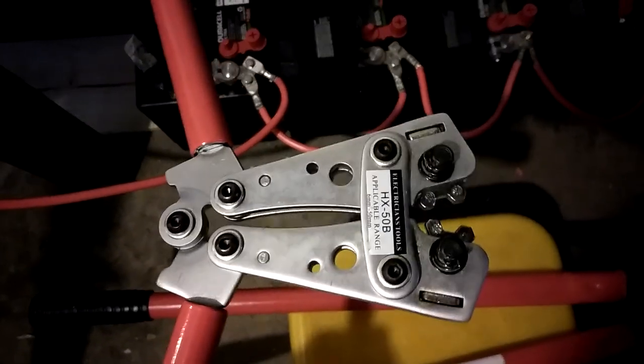If you're getting wire cutters, I have to suggest this: you want the rounded cutters, because if you get the flat ones, that flattens the wire and you're not going to get your lugs on there to make your own cables. I've recently been in the mode of making cables. You get all the stuff at your local hardware store. This crimper is from eBay — I don't remember the price but it's very efficient, I love it.